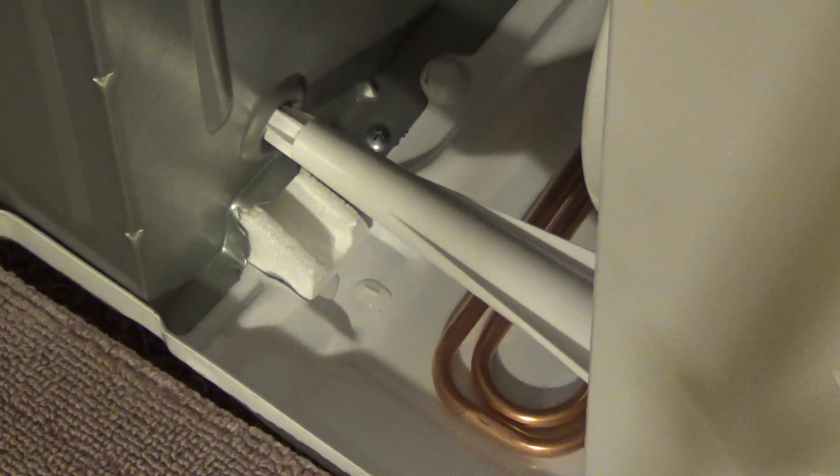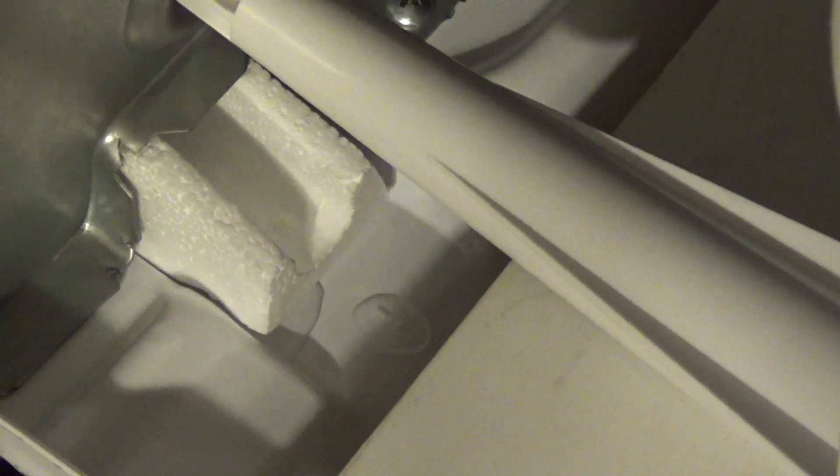So we're going to drill the hole. I have a block of wood here which I'm going to put in here like this, so that if the drill bit slips it will hit this and not go into the refrigeration line. That white piece of styrofoam right there is where the condensation comes out. You can in fact see some condensation there that has come out from just moving it around after I used it last. So what I'm going to do now is drill the hole right around where that bead of water is.